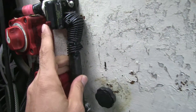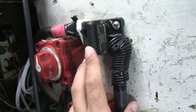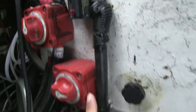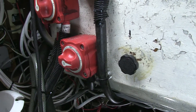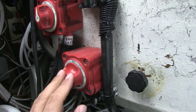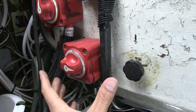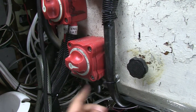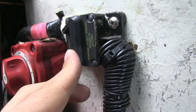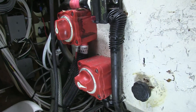This is actually not just a fuse — it's a fuse and also an effective switch. When I press this, I've opened the circuit, so this battery switch is effectively redundant. There's no need to have it; the circuit is doubly switched right now. You could simply run the cable directly from the battery over here and just use this circuit breaker to turn the windlass on and off.